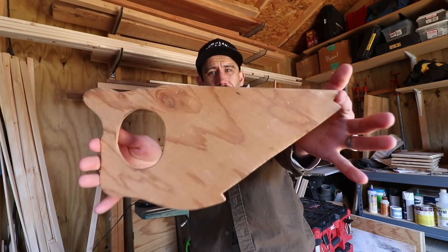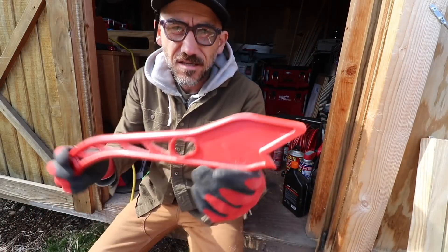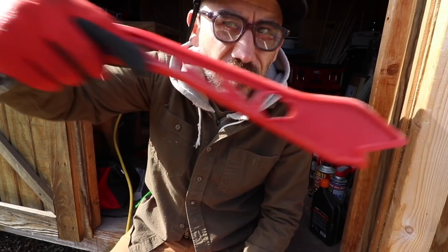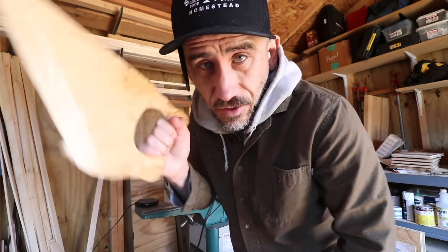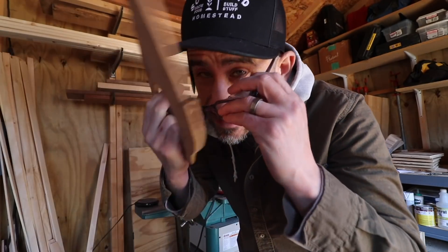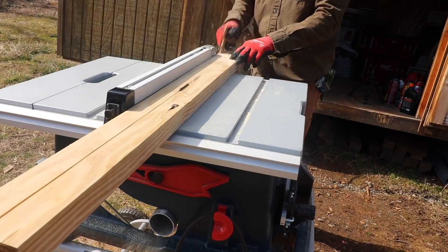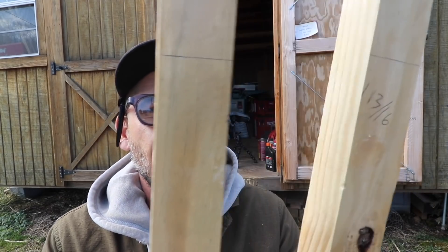Also, push stick guys — push stick. That's my homemade push stick. Here's another push stick that came with my table saw. That's what you want — to be able to push your piece along — because you don't want to get your hands in there. In case you slip, you might take your hand off. When you start the 2x4, you want to place it against the blade first, and while you're holding it with one hand, use your push stick to push with the other.